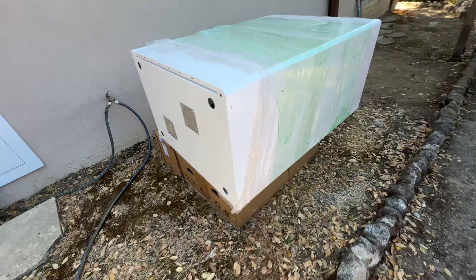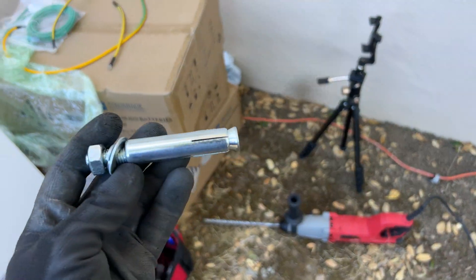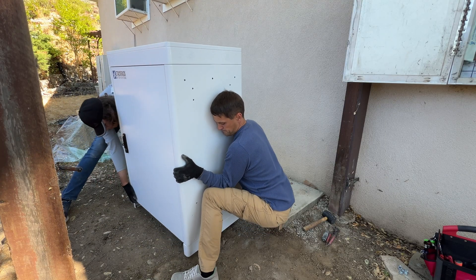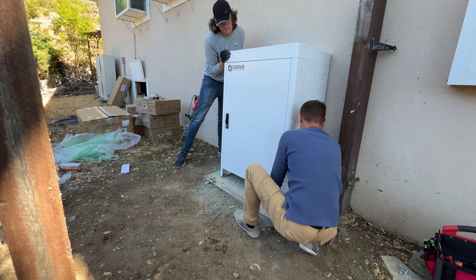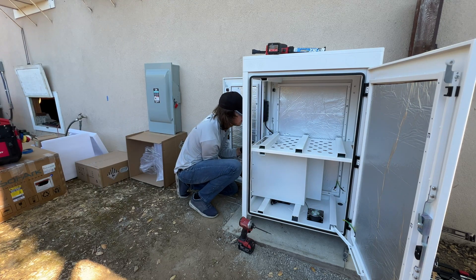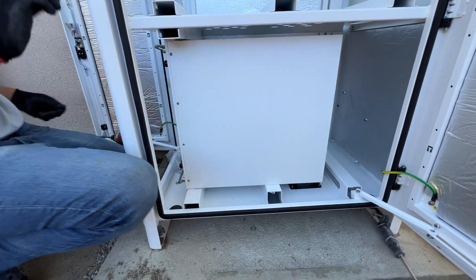And this is the gutter box. Here's the pad we did yesterday, and here are the anchor bolts that come in the package with the cabinet. We're going to drill the concrete pad after it cures and install the cabinet. The battery cabinet is from stack rack — what's great about it is we have 3 doors so we can easily access batteries from any side. We're installing 3 modules, the newest batteries, 5.12 kWh each, and we're using the bottom shelf to keep the center of gravity lower.